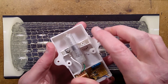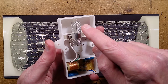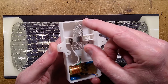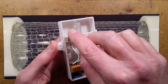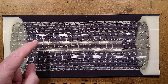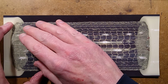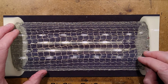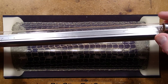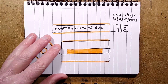You'll be getting deja vu if you've seen my ozone videos — here is a dielectric barrier tube ozone generator, the type used for sterilizing cabinets. In this case there's a little glass tube with the electrode up the middle and an outer mesh, designed to couple electrically over to the surface of the inside glass via the gas and create a capacitively-coupled discharge that creates ozone. This Excimer tube will create trace levels of ozone. That may be why there's a fan to stir the air, and also because the traditional tube has electrodes inside but the Excimer tube doesn't, which means it's potentially going to have a decent lifespan — electrodes are usually one of the biggest weaknesses.